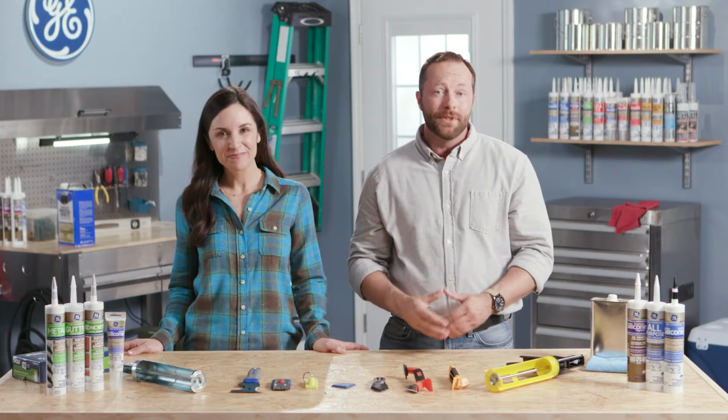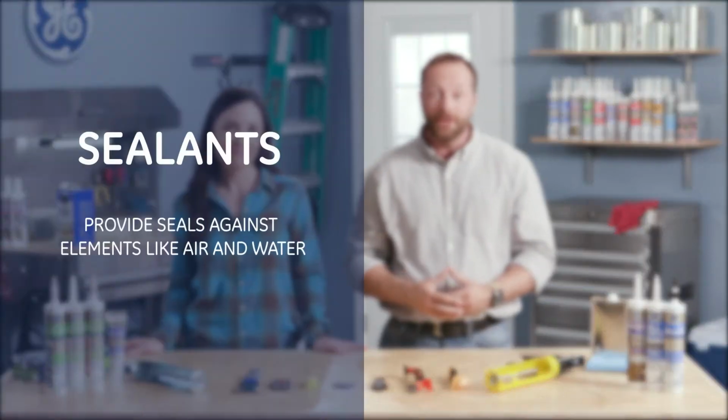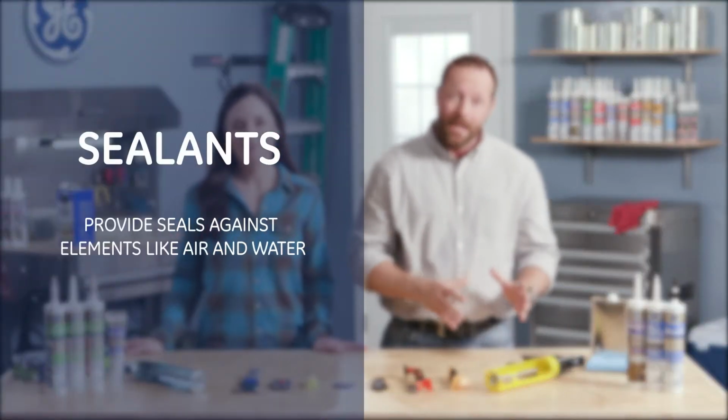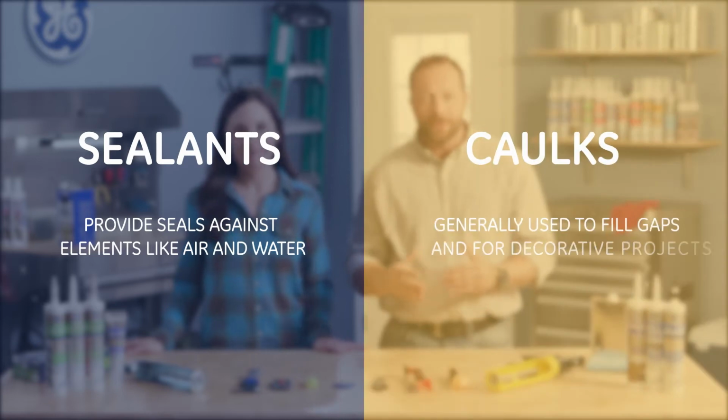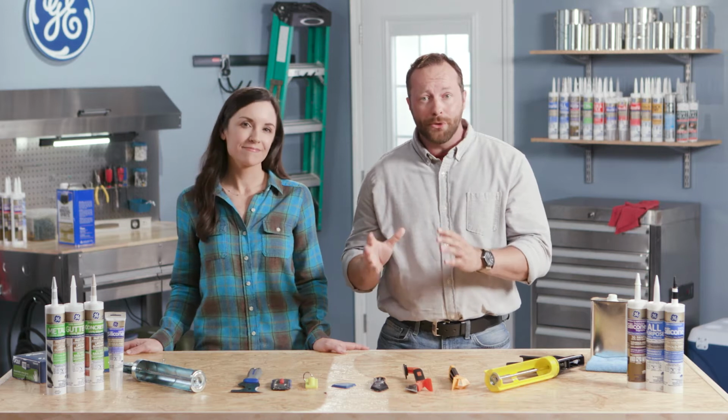Now, just as a heads up, the terms caulk and sealant are often used interchangeably. Products that provide a seal against elements such as air and water are sealants, and caulks are products that are generally used to fill gaps and for decorative projects. As a general rule, we recommend sealants for outdoor projects.